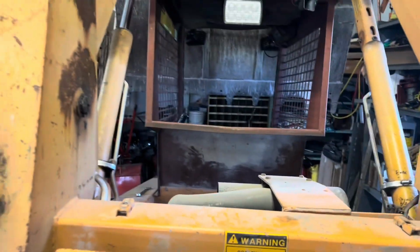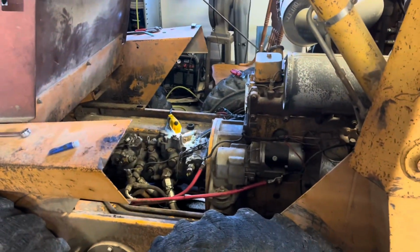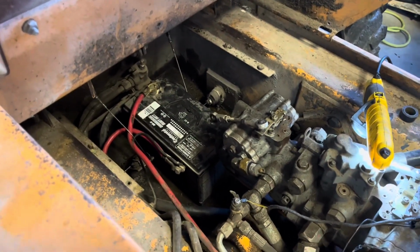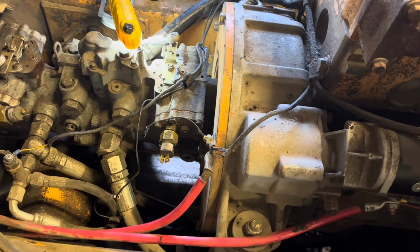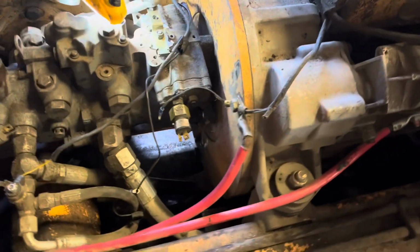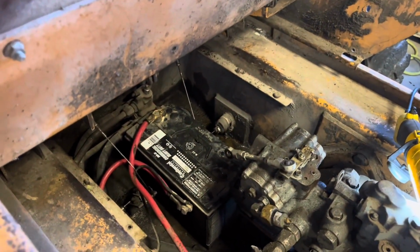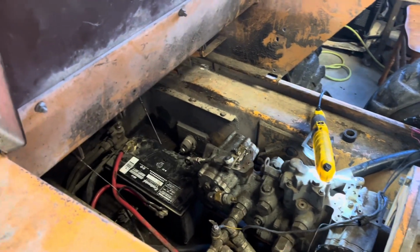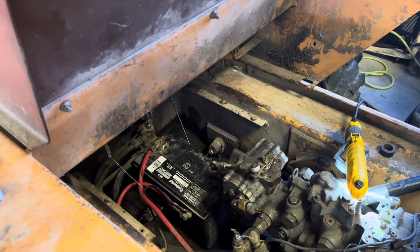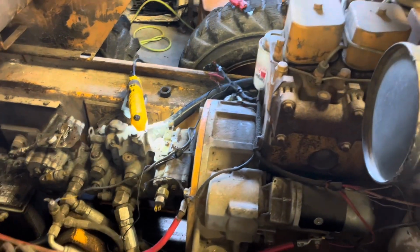So, which tells me I probably have a pretty big hydraulic leak somewhere on this machine. Based on how much oil-soaked mud I got out of the belly pan of this, I'm assuming it's either coming from the front seal of the twin pump, but I don't see any evidence of drips from the bell housing, or it's coming through those parking brake boots because the wheel motors are pushing fluid through a worn out seal. Both of those are guesses. I don't even know if it has a leak at all, but being that it was so low, it's hard to imagine there isn't.